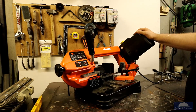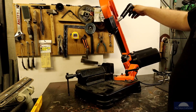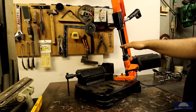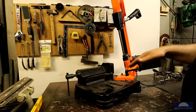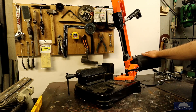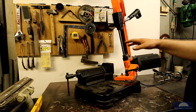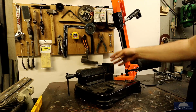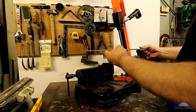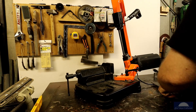Anyways, what I want to do today is make this a more versatile tool for my workshop by making a table that fits in here, so I can use this as a vertical bandsaw instead of a horizontal bandsaw. It would be really good for fabrication projects. I was watching a video by Justin from Good of the Land and he had a similar product. He put a tube in here with an angle on it and a big piece of steel to make a table, and I think it's a really good idea.